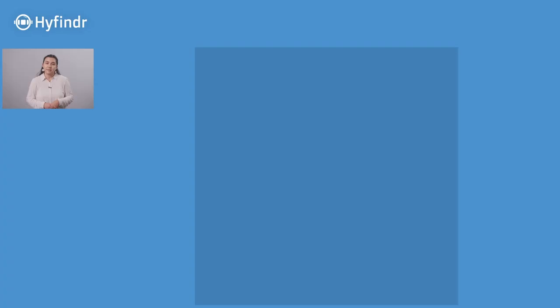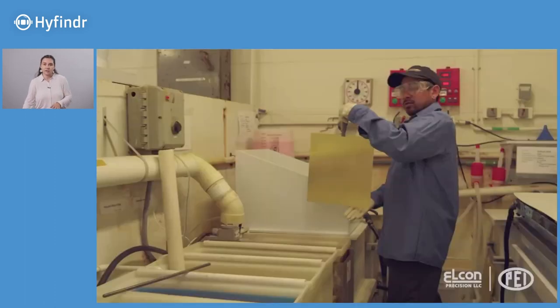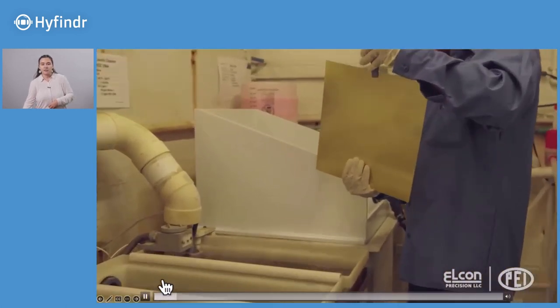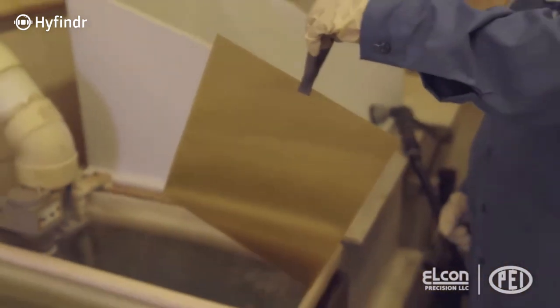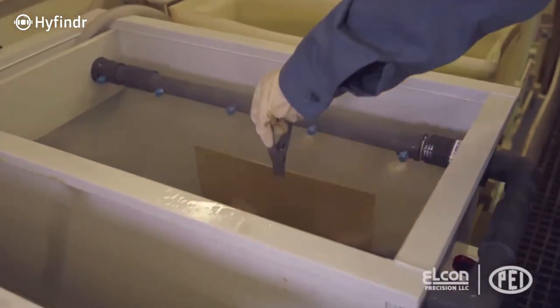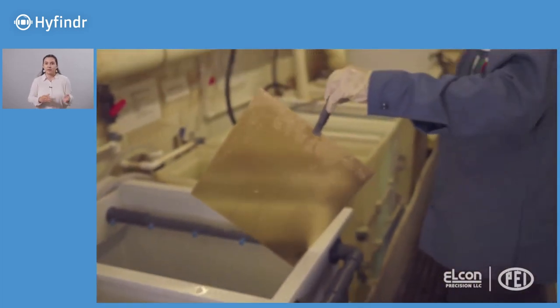These are all metallic materials. Moving on to the next step: cleaning. Cleaning is a really important process because it prepares the metal surface for lamination. The operator dips that metal sheet into tanks of degreasing solutions and mild acidic solutions that help take off any oils and contaminants on the surface of the metal. That allows the photosensitive film to adhere so we can print the image and continue with the etching process. It then gets rinsed with water, dried, and is ready for the next step.